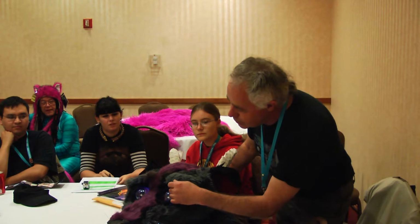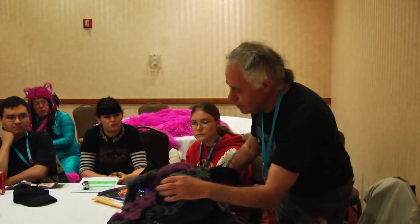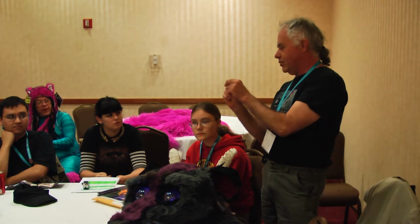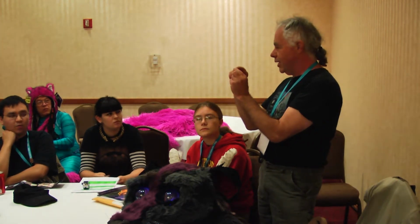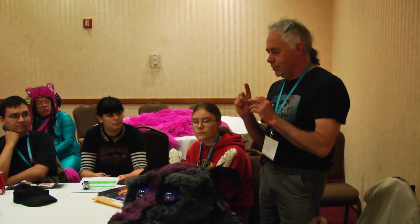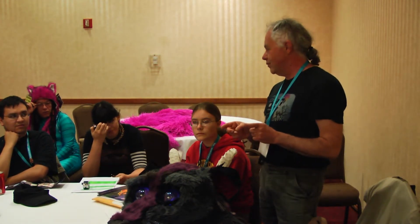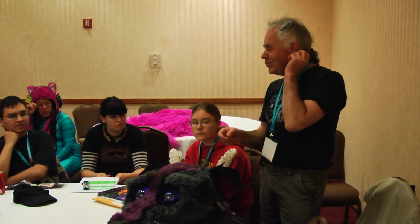But you know what, you notice one of my servos isn't working so great on the eyebrows. They have really, really tiny ones, almost this size, about maybe half an inch cubed. Those guys are incredible. They're quiet, and I've used them for the eyebrows, but they don't have much power. So if you're doing something simple like just moving one strand of hair, they're great. But if you're trying to move an ear, they're not powerful enough. And the eyebrows, as you can see, are actually not powerful enough either.